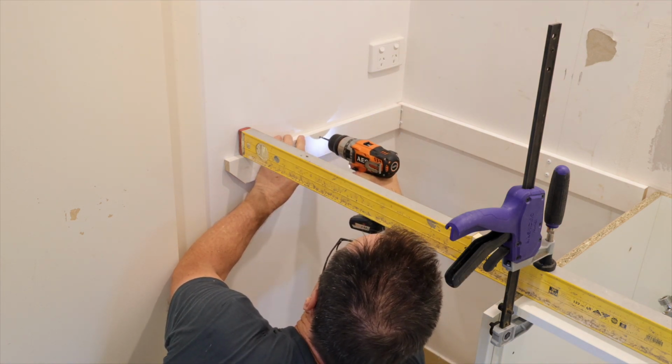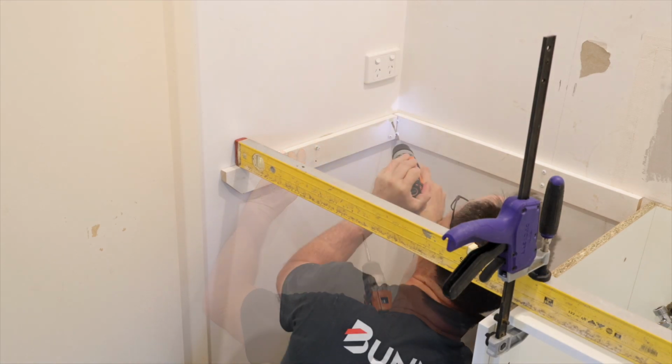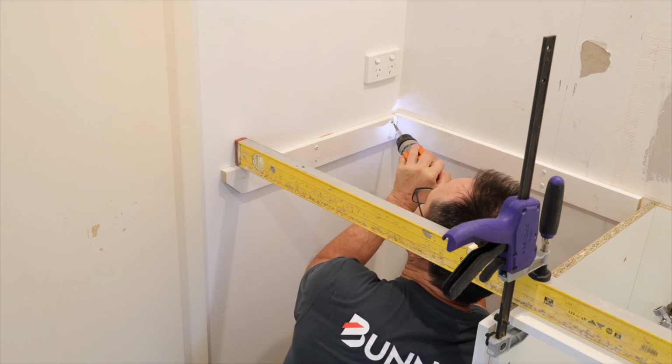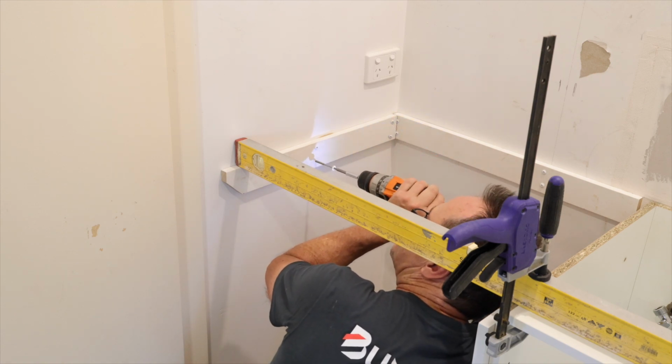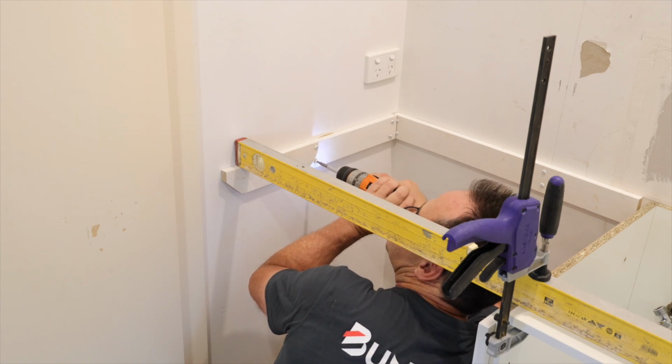Then make a 45-degree cut on part of the bottom of the front edge so it won't be quite as conspicuous, and so that a protruding sharp corner won't be a hazard. Use that long level for alignment again, and then you can pre-drill and glue and screw in place.